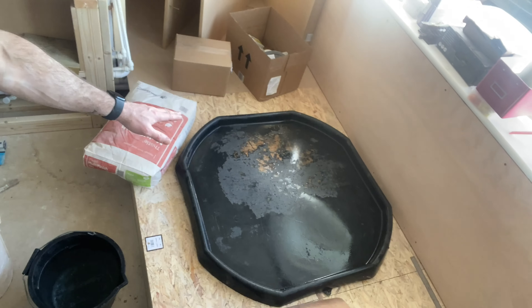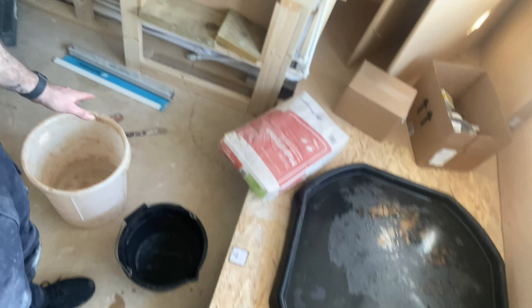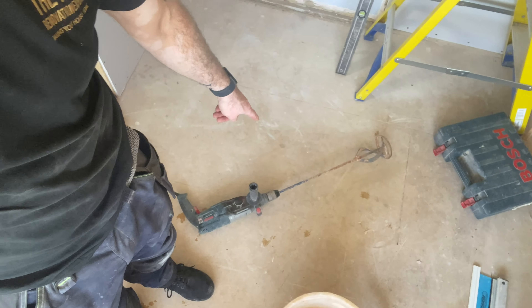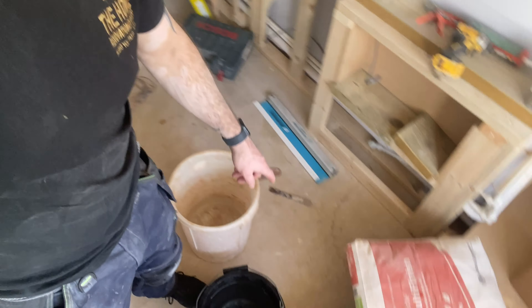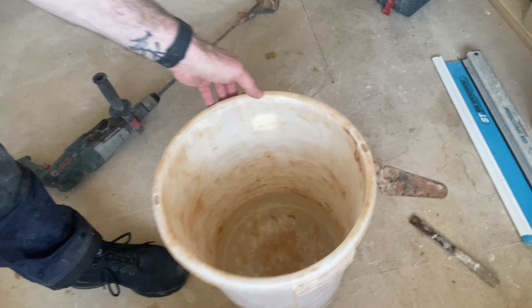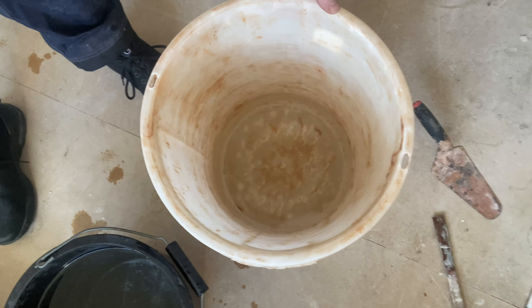Plastering gear is now out. I've cleaned up all my trowels, sanded them back to the knife, and got the plastering drop set up. I've dropped the plaster on the board and once it's knocked back I'll keep working it. Plastering bucket, big mixing paddle - a spinning shimmy, that's the technical terminology. Half a bag of multi-finish and some spare water. I'll drop in half a bag and keep adding water to get to the right consistency of creamy goodness, and then start splatting it on.